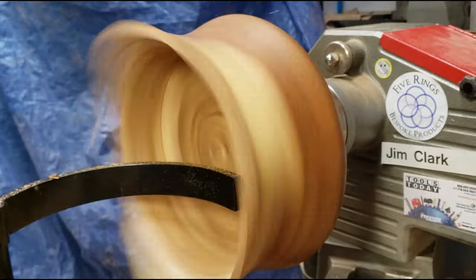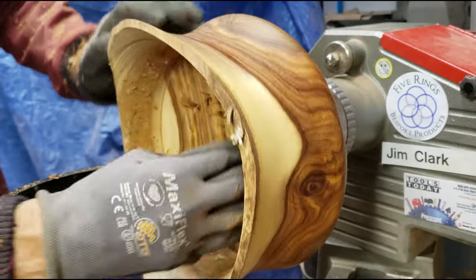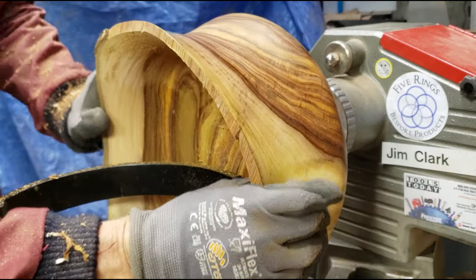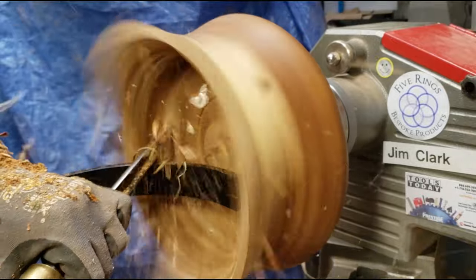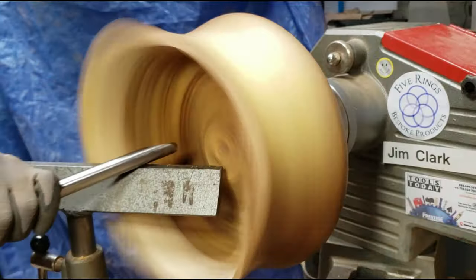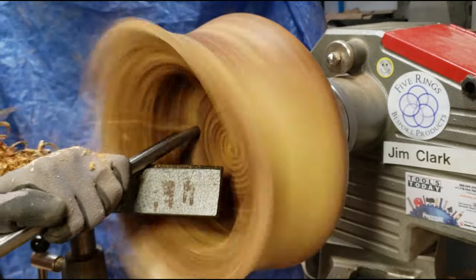Now that was a catch — that's where the wood overwhelmed the cutting edge of the tool and pulled it down, pushing the other end of the tool up pretty violently. It didn't hurt; it gouged the bowl a little bit but wasn't too bad. Since I had to keep my hands further back away from the edge of the bowl because of the live edge, I didn't want to get hit. It made hollowing this very difficult with the overhangs and the angles I had to go for.